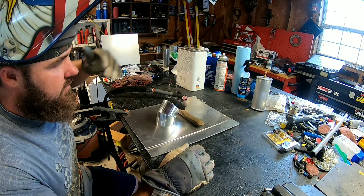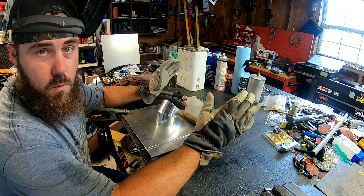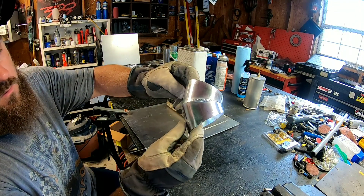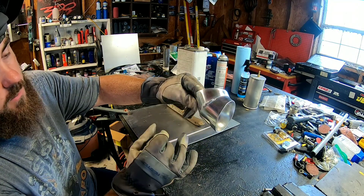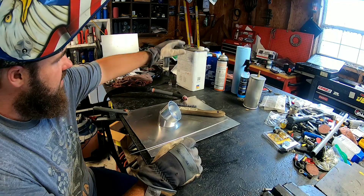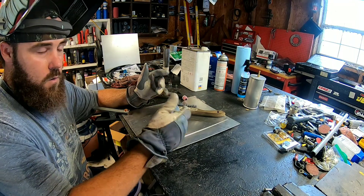Alright, I did a time lapse of the welding but it's pretty boring. I'm not trying to make welding tips-and-tricks videos — I just wing it. The most important thing is cleaning. This was done without any filler rod, so I basically just bonded the two pieces together. You want to scuff it up real good with a stainless steel wire brush and then use lots of acetone — the cleaner it is, the better the product.